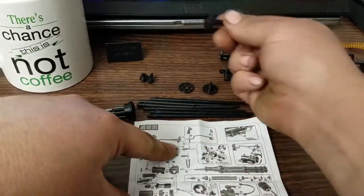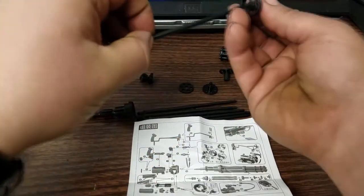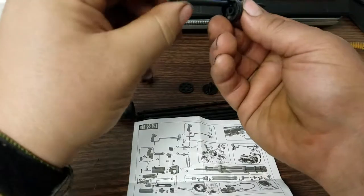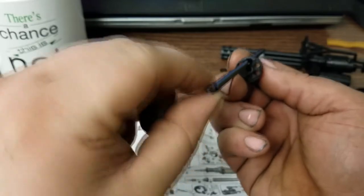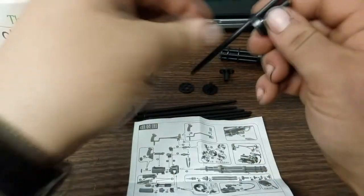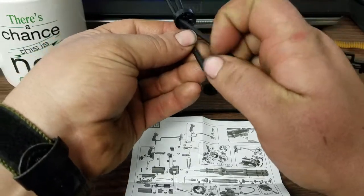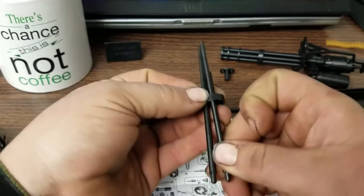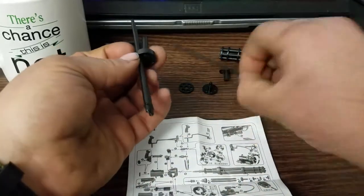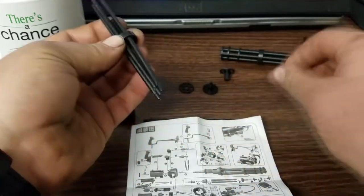This is the most important piece for holding this all together — this is the one you want to start dropping all the barrels through. Those two little sprues I mentioned before: if you adjust them to where they flatten out against the sides of the inside of this, they'll keep it from rotating while you're assembling it. Don't worry about how well aligned they are yet — as you slide on each one of these rings, it lines up and tightens up.